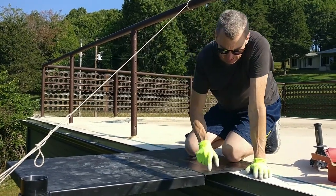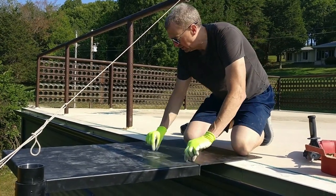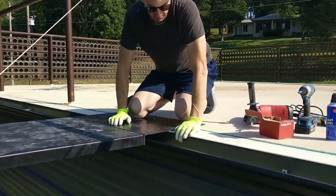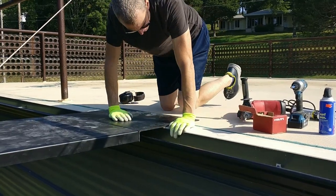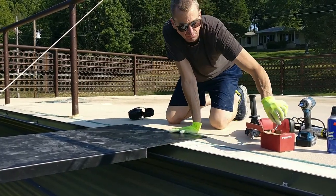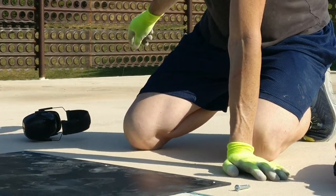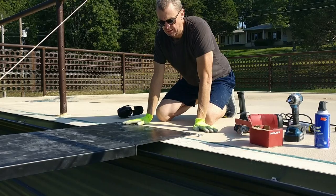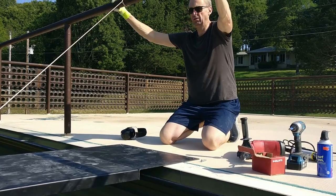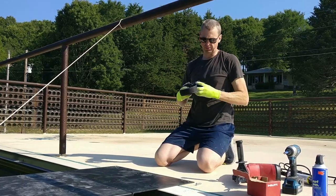Now, this is the plate that we had made, and so it has the right angle here, and it's bolted together here. It goes over our rain gutter, and then the next thing we'll do is the anchor points, which are 1, 2, and 3. We're going to use the same exact Hilti screw that we did for all of our railing. Once that is done and we start building our treads, we'll cut the posts here and here, and we'll add our last two pieces. Let's get started with the old hammer drill.